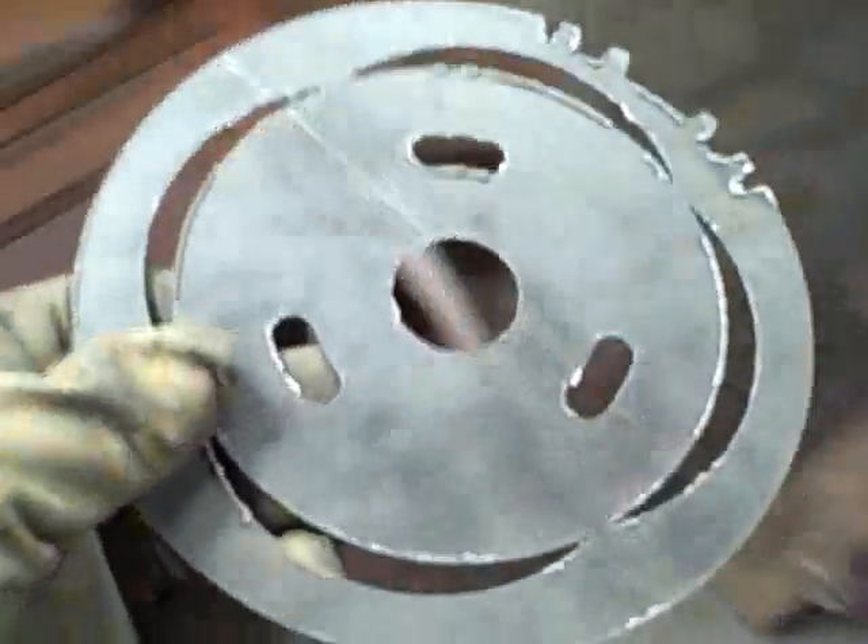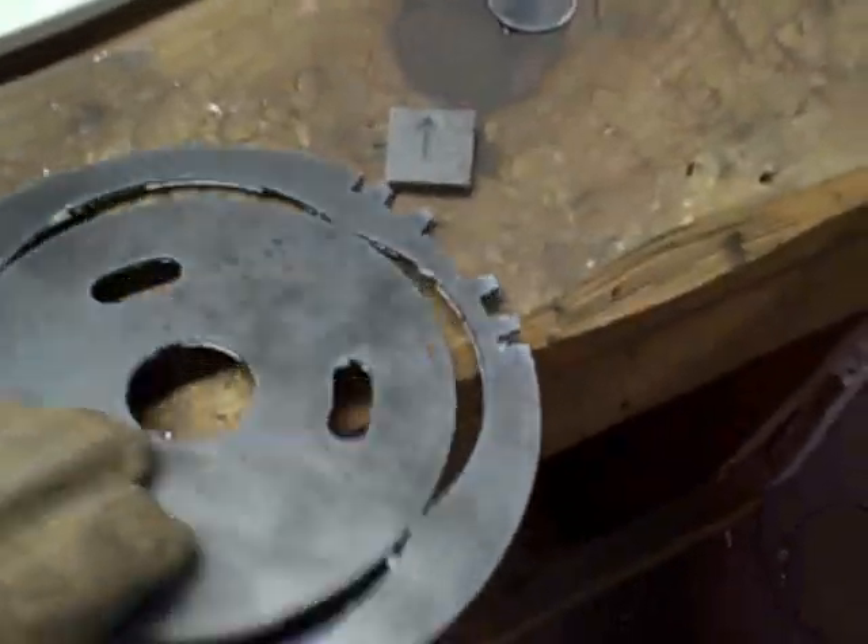So that's generally my procedure at the moment. All that stuff on the teeth there — generally I'll just tap it on the floor, whatever edge you can tap it on. That gets rid of what's on that edge and a lot of times stuff in the surrounding areas. Whatever's left I tap with a wrench to pop it off. Sometimes I put them in a cardboard box — especially with smaller pieces, like these little quarter-inch thick squares I make as part of my machine calibration. I'll put a pile of those in a box with a couple of these, shake the box around a little bit, and that'll knock them all off fairly quickly. Actually, I've been thinking about building a machine to do that.